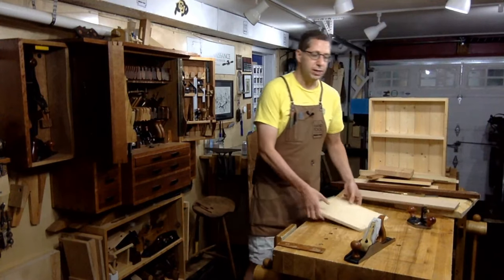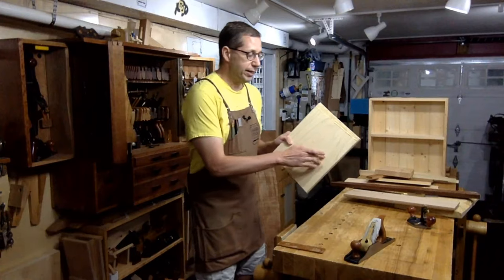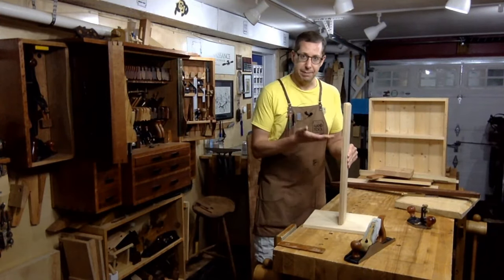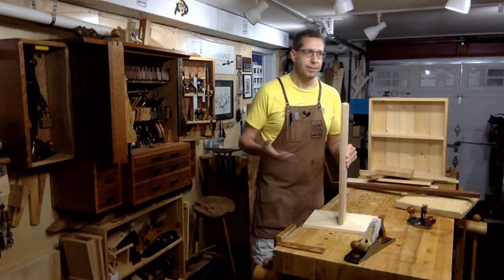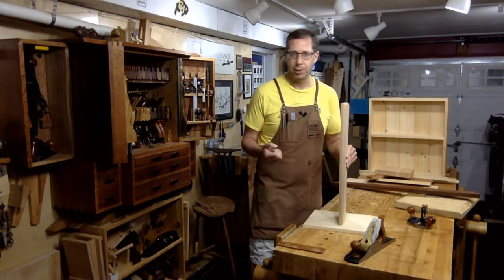Now, we are assuming that it's not so out of flat that, once I've cut that and once I've got the shelf in place, I can't bottom out that dado or flex out the cup in the board with hand pressure. If it's a 6 foot long board, it's going to be hard to close it with hand pressure, so sometimes clamps can be brought to bear.